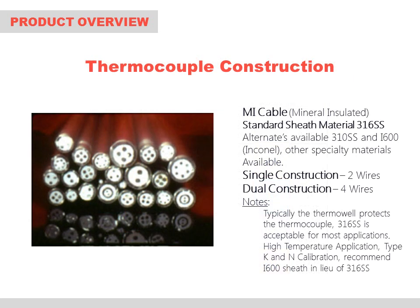Quality and rugged thermocouples start with mineral insulated cable, or MI cable. This modern construction replaces the traditional exposed thermocouple lead wires separated with ceramic insulators commonly used years ago. Standard sheath construction of this cable comes in a number of ODs, the most common being 3/16th inch, quarter inch, and 3/8th inch OD, and in 316 or alloy 600 for higher temperatures. We receive this material in 100-foot coils and have numerous coils of the different thermocouple calibrations, diameters, and materials. The MI cable is cut to length, the junction is made at the one end, and lead wires are made at the other end, referred to as the cold junction.